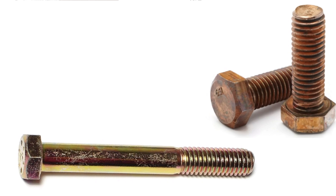With that, we know what size chain plate and what size bolts we need. Now we just need to figure out where to buy them. I haven't been able to find silicone bronze in the size we need. If you guys know any place that sells silicone bronze as a bar — ideally half inch by two inch — that'd be really good. Also large bronze bolts, either five-eighths or three-quarter inch, but not fully threaded. If you have any good suppliers to recommend, please let me know. Thanks for watching, and we'll catch you next time as we continue converting Wisdom to having external bronze chain plates.